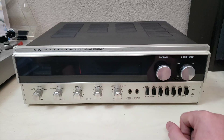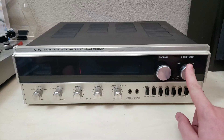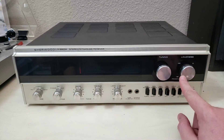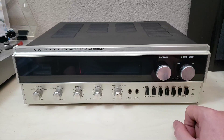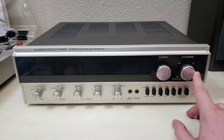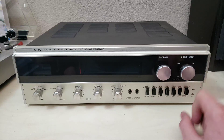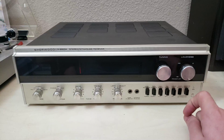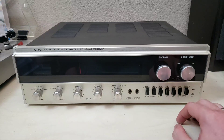This one's been a little bit fun because you can't use Deoxit on it, because the inside of the main volume pot is really susceptible to coming apart. The inside has a kind of metal-coated plastic wiper — that's how the actual potentiometer works — and it's known to come apart if you put Deoxit on it. So there's a little bit of scratching in the volume pot that I couldn't get rid of, but it's really not too bad in my opinion, and everything else just working it came out really clean.